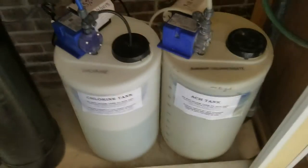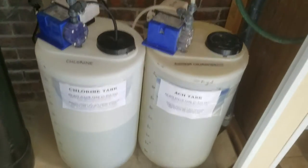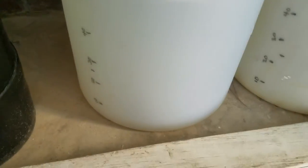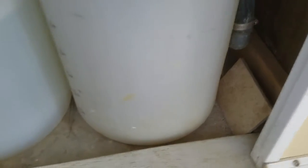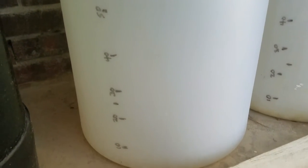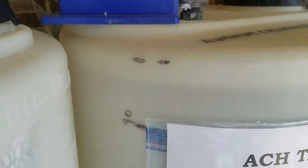The chemical tank inspection involves checking to make sure that there's still enough liquid and no leaks around the tanks. Any puddling down underneath the tanks would be a problem. The procedure says make sure you have at least six inches of liquid — six inches of liquid would be approximately 30 percent on the tank. But whenever the level drops below 50 percent, you would put 50 percent of a mixture into the tank.